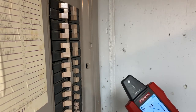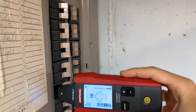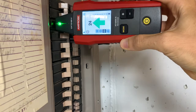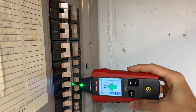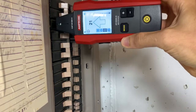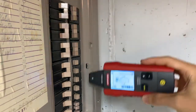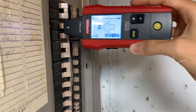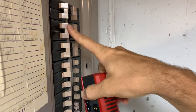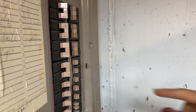This is called breaker finding mode. You see that green arrow — when it turns on, it's saying I have a signal. This thing will auto-adjust and only remember the strongest signal. In this mode, you have to go around the whole panel once. Then the second time, you had several green arrows. Going around again — we got a green arrow here, two green arrows this time. Going back and forth: got a green arrow here, and I can still get it over here, but it should give you one being stronger than the other. You can see it is stronger down here. And if I use my brain a little bit, I know my outlet in the kitchen is not on a 60-amp breaker. So down here — it's breaker number 20, which I know is the right breaker for that outlet.